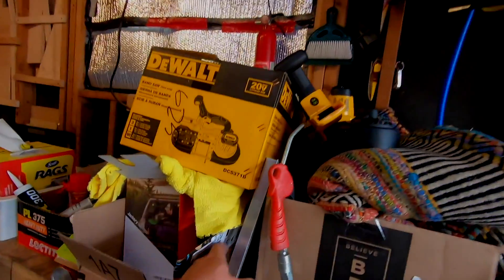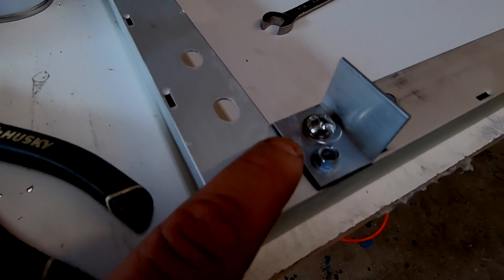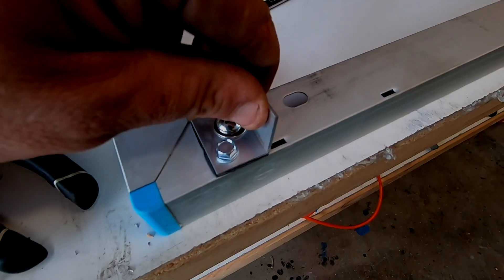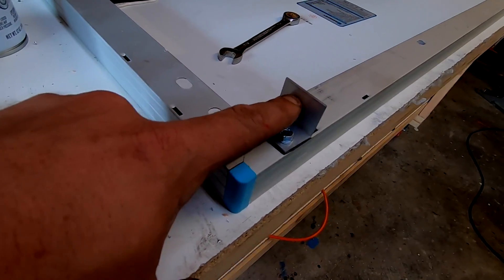I took a piece of quarter-inch angle aluminum and cut it down to one and a quarter inch. I used one of the factory holes from the Renogy panels and put a quarter-20 bolt through there with a lock nut on the other side and a washer on top, then added my own self-tapping screw as well. On the underside there is some 3M double-sided sticky tape. I have to finish four brackets on this panel and then do one more panel. I'm going to self-tap two screws this way into the frame and also add 3M tape to the underside, so they really shouldn't go anywhere.